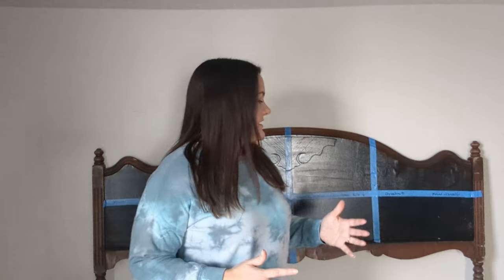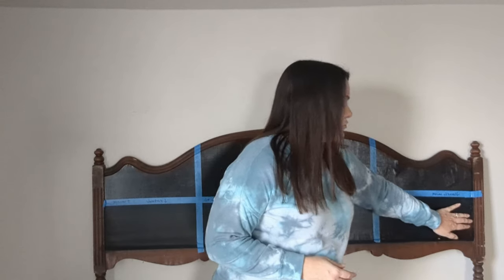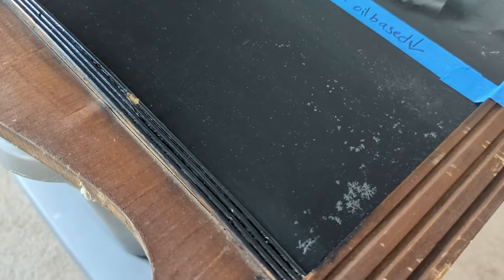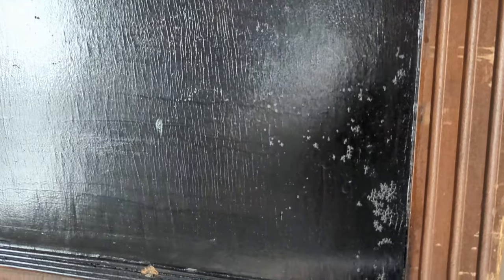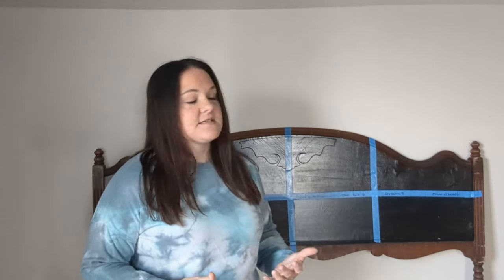The Minwax oil-based polyurethane I just don't like. It still feels oily even now, three months after painting and sealing — not because it isn't dry, it's completely dry, it just feels oily. I didn't like applying it, and it also developed a strange crystal-looking effect in one corner, almost like snowflakes on a window. The oil-based finish may have reacted with something, either a cleaning issue or something in the original finish below the paint. Honestly, while oil-based polyurethanes are great for stained wood, I'm not going to use them for painted wood anymore — there are way better options.